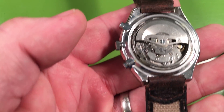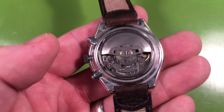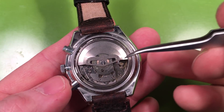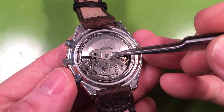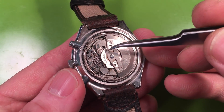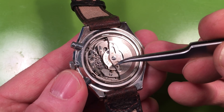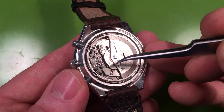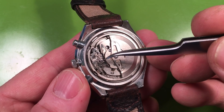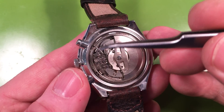Your movement is in good condition functionally, so there's nothing really to worry about there. The watch has never had water inside — the movement is a little bit hazy and it's had some non-Seiko work before. These screws are not Seiko; they function, but I'm going to want to replace them with correct Seiko screws simply to have the right parts in place. I also noticed when stopping and starting that the pillar wheel is kind of hanging up a little bit and doesn't want to click over nicely, but that's another function of cleaning.